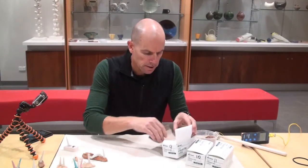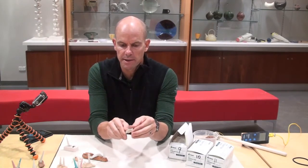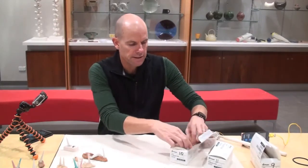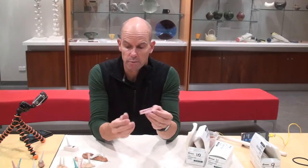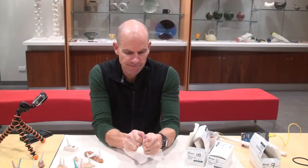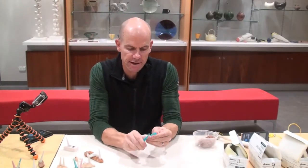So how do you set your cones? Cones come in the box with two cones joined together typically. Hold your cones at the widest end, two hands at either end of the cone arrangement, and bend downwards and the cones will snap apart. So I've got two cone 9's here. And I'm going to do a cone 10 — the next temperature up, the temperature I'm actually aiming for. These ones are pink; I imagine it's just food dye that burns out. And then the blue ones — these are cone 11's.